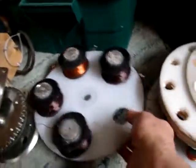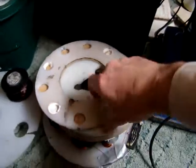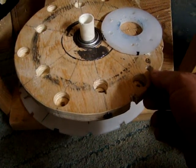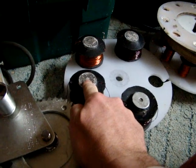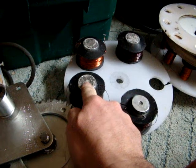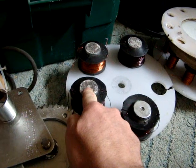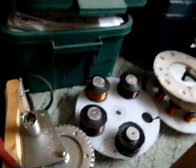The older designs used disc-shaped stators like this one, where the rotors turn on a single central bearing. The problem is that these bearings always wobble, and because of the very strong attraction of the magnets to the cores of the coils, it's very difficult to keep the gap between the magnets and the coil cores narrow without the magnets hitting the metal of the cores.